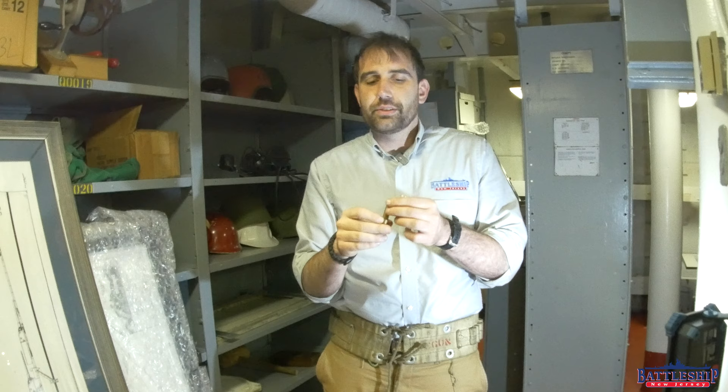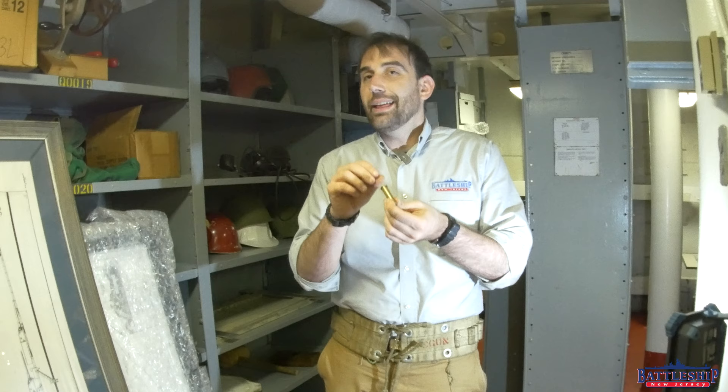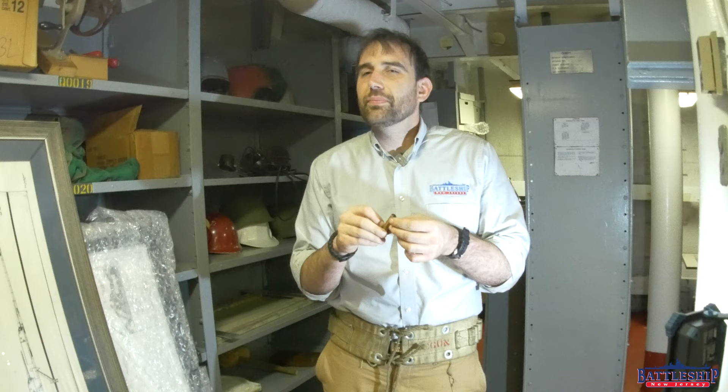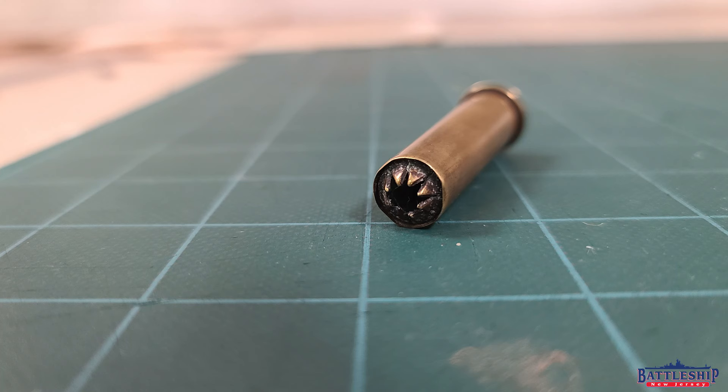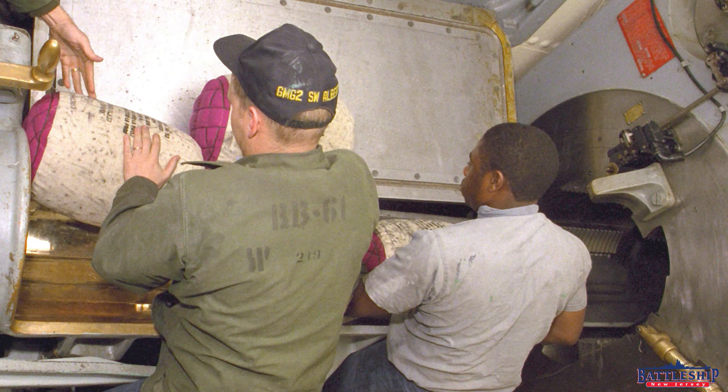You can fire it using the hammer that's built into the mushroom part of the gun — they'll hit the firing pin, they'll drive into this primer and then cause the ignition. Or, say you're firing from a main battery plot down inside the ship. You pull the triggers and it sends an electronic signal. That signal is transferred through the casing of the gun into an element on the inside that heats up — it's basically an exposed wire. And when that heats up, it causes the 30 grains of black powder that's inside of this to burst out the end of this blank primer. And that fires into the gun into a black powder patch that's sewn into the back of the last 16-inch powder bag, and then that powder ignites.